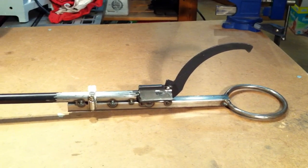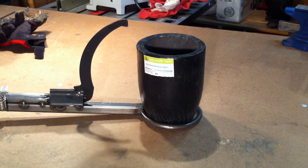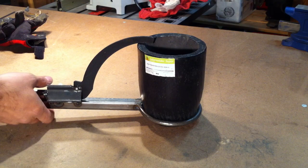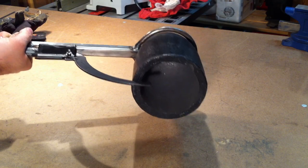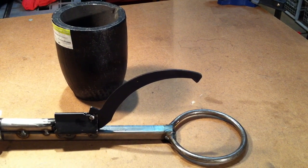I've finished it up and figured out the trigger mechanism. The way this works: pull the crucible out of the furnace using my lifting tongs, place it in the pouring shank, pull the trigger — watch the finger clamp down on the crucible, holding it in place. I can lift it, move it around, and most importantly pour out the molten aluminum. That's my pouring shank — I am one step closer to casting aluminum. That's the next project.